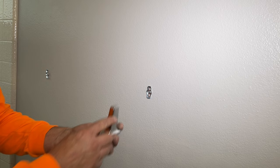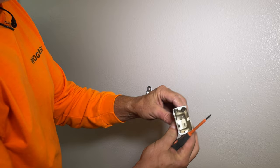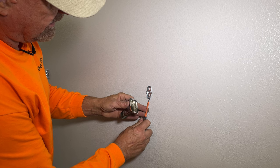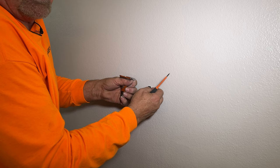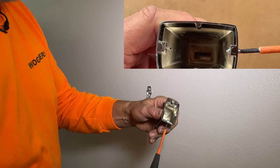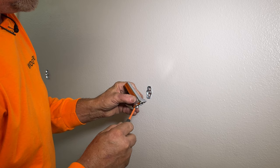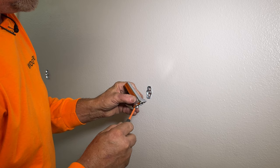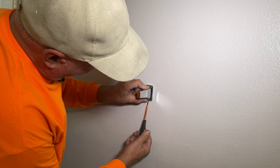When you put your brackets on, you have the set screw — you want the set screw on the bottom. I know it's easier when it's on the top, but aesthetically you want it on the bottom so you're not viewing it. This is where you take your little mini screwdriver. If you look inside here, the set screw goes in behind the bracket — the bracket's on an angle, so when the screw tightens down, it pulls it in towards the wall and makes it nice and firm. You need to loosen that screw until the tip is down, place it on the wall mount, and then tighten the screw down while holding it against the wall. Once you feel it start to tighten up, cinch it down — nice and firm.